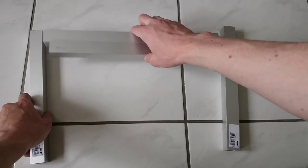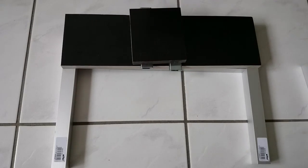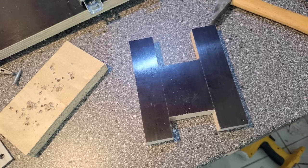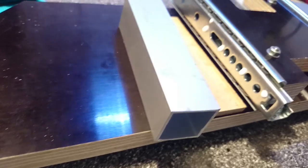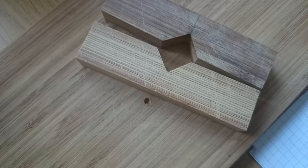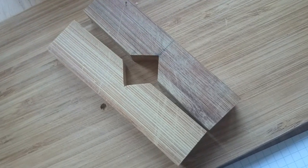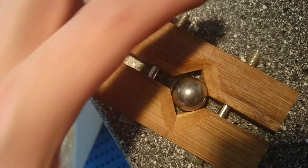Time for building the bridge. It will look like this, more or less — aluminum bars left and right that suspend the bridge, and a horizontal wooden board in the middle. The first two sliders are attached in the same way as with levels 1 and 2. Then I attach sliders 3 and 4 at a 90-degree angle by gluing them to the aluminum bars first, so I can drill the holes precisely after the glue has dried. The bars are then screwed to the sliders and to the board with a piece of particle board as spacer. My tool holder must be of very hard wood, so I used a kitchen cutting board for that. A square is cut into the pieces for the holder and its sides are trimmed so the tool fits nicely. I use a steel ball to center the walls perfectly, grinding off material from the side that is too long until the steel ball touches all sides equally.